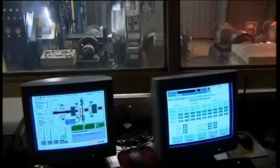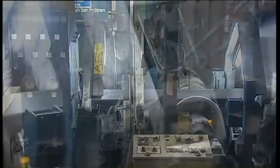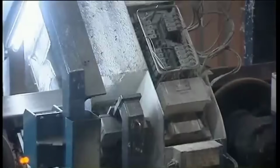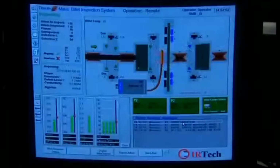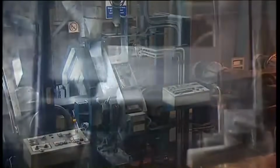At T6 transfer, the steel entered the automatic inspection line, beginning with a roll straightening machine, employing pairs of rolls and hydraulic pressure to ensure bars met specific straightness criteria. Certain billet qualities, or those demanding superior straightness, underwent further straightening by an offline gag press before proceeding.